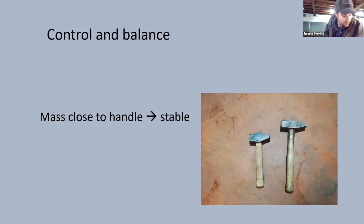Then there is balance, which is a very important part, as well as the form of the hammer regardless of its weight. When the mass is close to the handle the hammer becomes more stable and more balanced, even when hitting from an angle or with a tilted hammer. Both cross-peen hammers shown are one and a quarter kilogram. The left hammer has more mass located around the handle, making it a more stable hammer. The other is a standard traditional cross-peen. When using the peening side of that hammer at an angle, the face tends to fall further and twists in your hand, requiring you to catch it and bring it back on course.